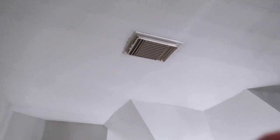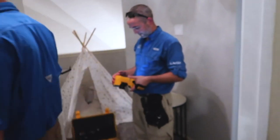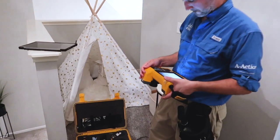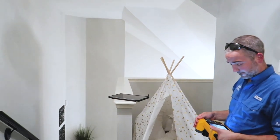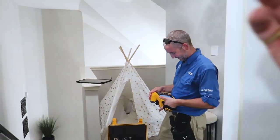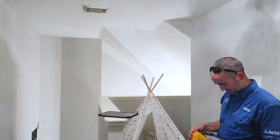When we were taking the temperature, this register is blowing out about 67 degrees, but this register over here is blowing about 60. So we know the duct systems aren't balanced very well. He's pulling out the infrared camera to help identify whether those water stains we see are active or not, and to double-confirm our temperature readings from the thermal thermometer — the temp gun.